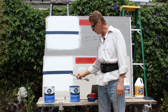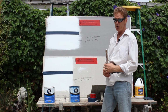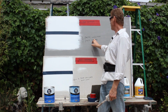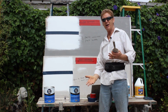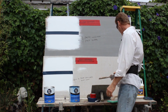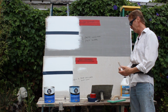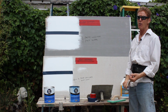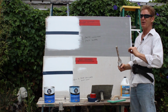about the color coats. When I use Weld Crete, I'll dilute it a little bit. Sometimes I'll go half and half. Sometimes I'll go 2 parts Weld Crete to 1 part water, and I use my own judgment. Now guys, this is what I do. If you watch what I do, follow whatever it says on any can, any of these guys here, so you don't say, well, Kirk told me to do this or that. But I'm showing you what we've been doing for 35 years in the trade. Every contractor I work for, stucco contractors, I know about 15, they do something similar, if not exact.